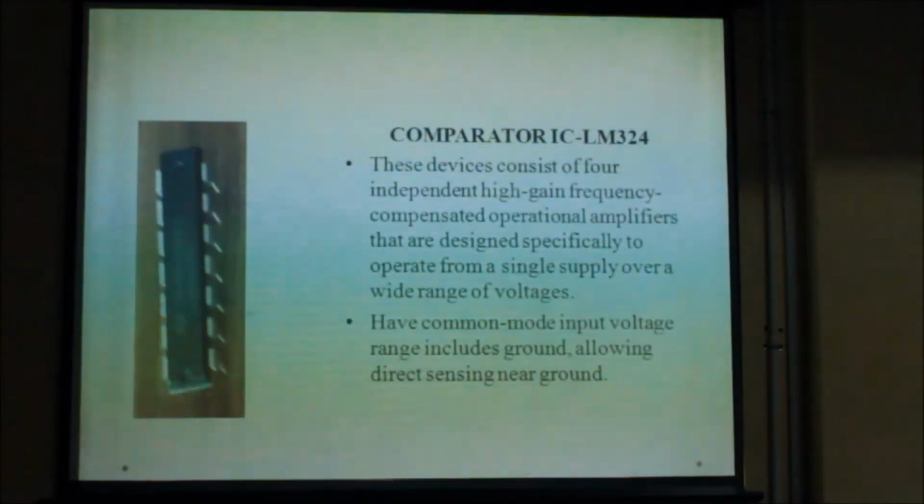Now our project is entitled Smart Gesture Control Dual Mode Robot. The reason we call it smart is only due to this IC because it has the feature of detecting an obstacle and allowing the microcontroller to remove this without changing its direction. This IC is capable of sensing the object and as soon as the object is sensed, it transfers the control signal to the microcontroller and only due to the microcontroller the L293D is directed through which it is moved.